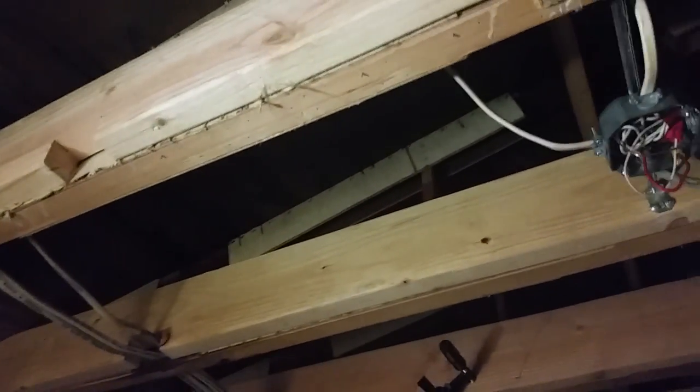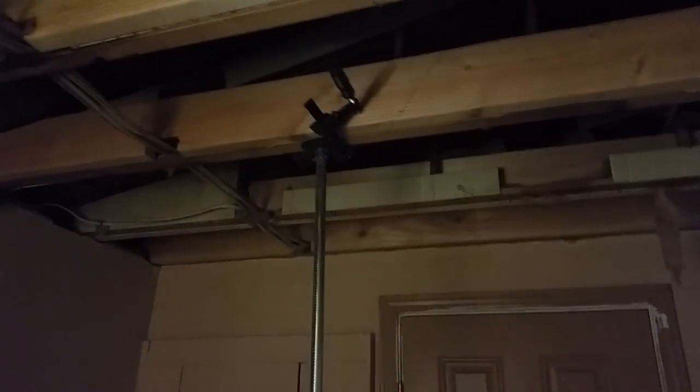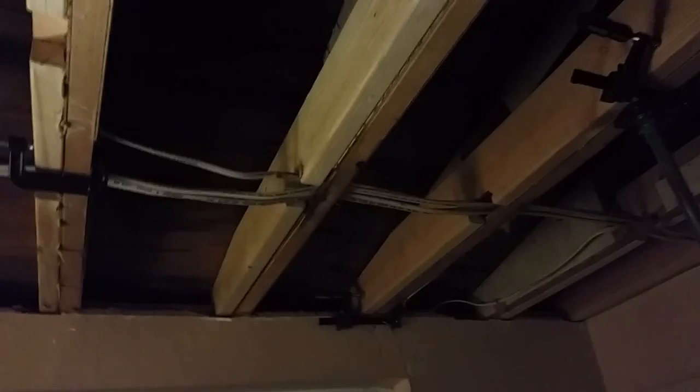It's a little dark in here — it's nighttime — but you can see I went along and put some liquid nails construction adhesive on these struts and trusses, and then clamped them together. I don't know if it'll help, but it can't hurt. I'm afraid to put any nails or screws in there — things are so flimsy. This one had actually bowed down a little bit, so I jacked it up. This definitely does stiffen them up a little bit. It's kind of scary when someone's up on the roof walking over here and you can see these things just flex.